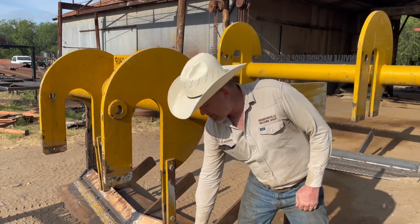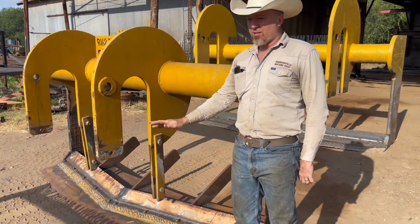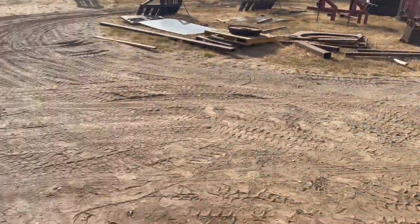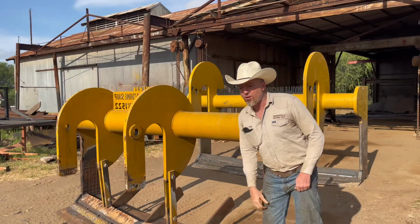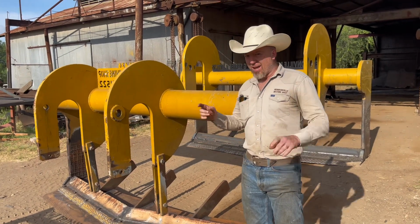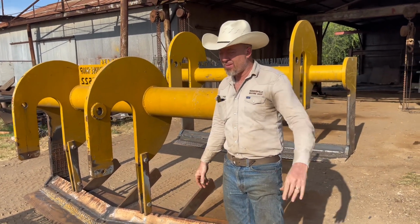Because when you're 18 inches deep in a Cat, D6 and down, your ripper bar is really close to the ground, and that really obstructs. So when you're plowing with a Caterpillar, D6 and down, you need the ground to look like this road here. Okay, you need it clean. Where with a John Deere, you can leave it a little dirtier. You can still have trees laying there, and they'll flow through the plow, where it won't so much with the Caterpillar, okay? Now that being said, when you get 850 and up and D7 and up, that changes.